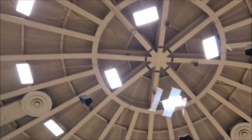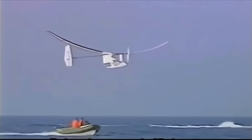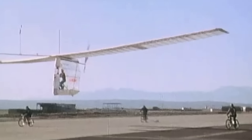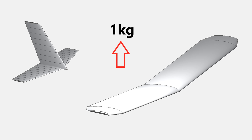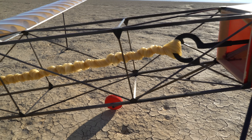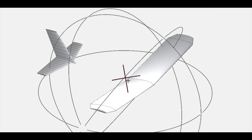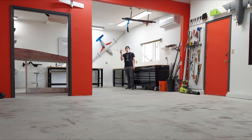I wanted to demonstrate the effect of extreme weight reduction on performance, as this can fly for over half an hour, as well as point out that his company actually saved this project later in the video. Instead, I drew my inspiration from human-powered airplanes. They are the right analog as they survive outdoors with a heavy human payload, while remaining lightweight and flying on minimal power. They also use real airfoils, which generate more lift and less drag than the flat plate wing from the first model. This allows the airplane to lift the same weight using less power. Since we are using a weak rubber band, this is exactly what we want. As I was no longer copying the toy airplane directly, I laid out the new wing and tail in my computer so that it had a better chance of flying the first time. I created a 1/5th scale chuck model to see if the computer was telling the truth.